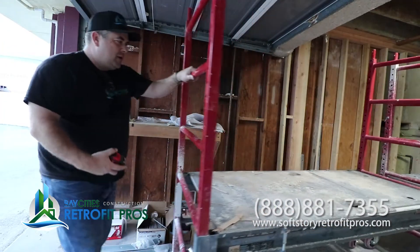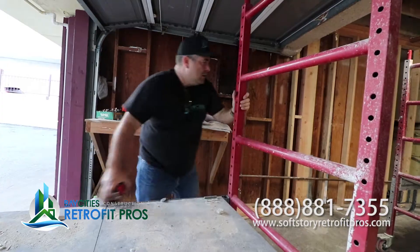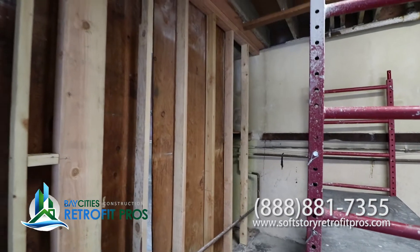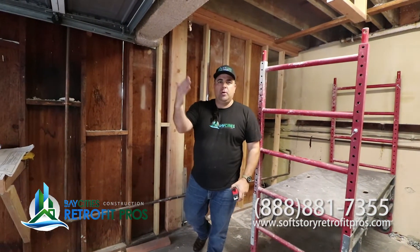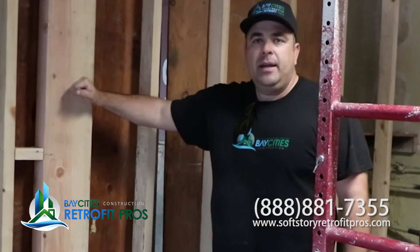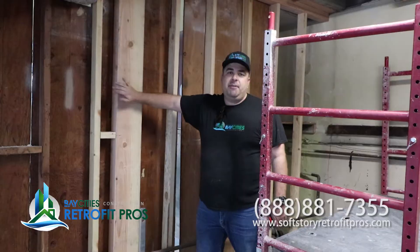Let's show you what's happening inside the garage. This is our scaffolding. So back here, I wanted to show you our new shear wall. Buildings are soft two ways — they're soft this way, and we're going to put a moment frame over there, and it's soft this way. In order to deal with this lateral resistance, we're putting in a piece of shear wall. It's specked out at five feet, but we did about six feet because we got a better connection here.